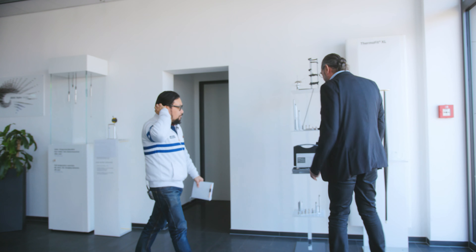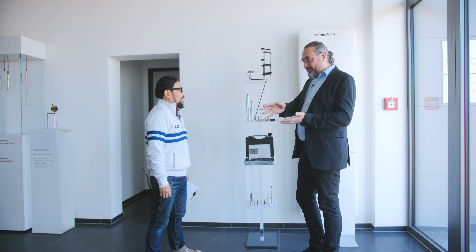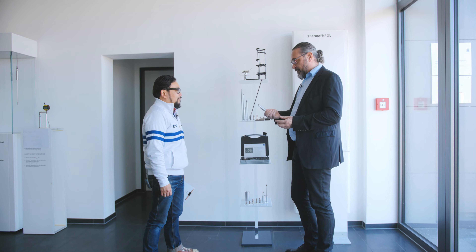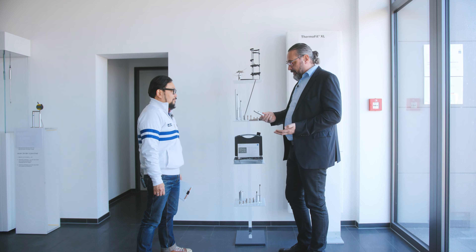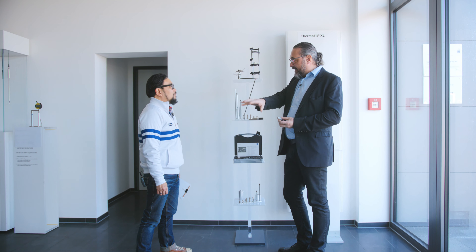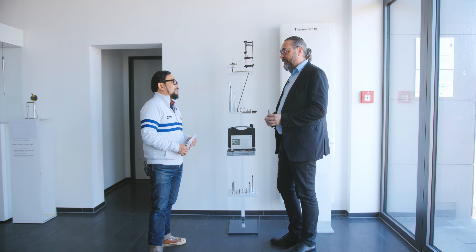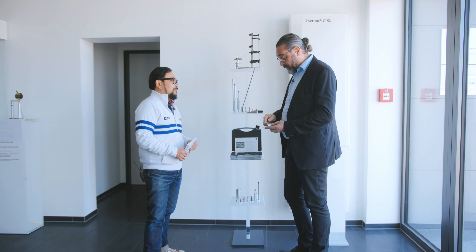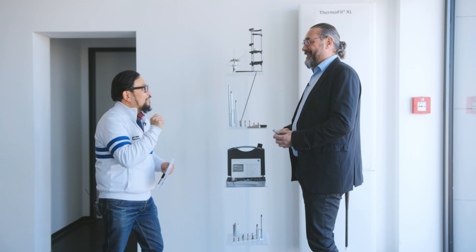So we look right here. In general, going back 25 years ago, all the machines are in the measuring room and we used aluminum extensions. No problem, because in the measuring room the climate is controlled, everything is good. But when the machines started going into the production line, you have the problem with different temperatures. And aluminum is not really good for temperature — not very stable. The extension itself is not too bad because a thick tube is stiff, but not thermally stable.